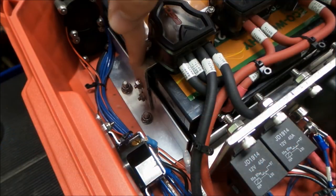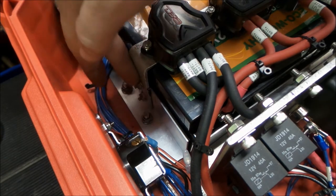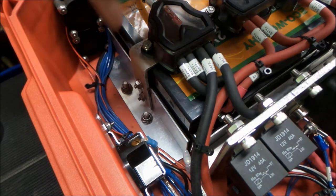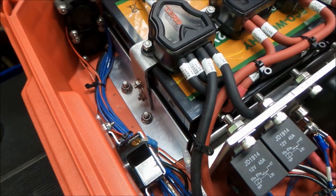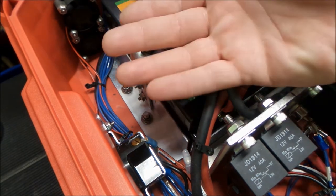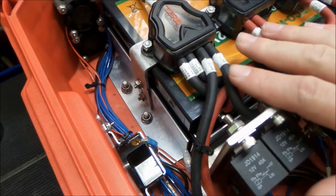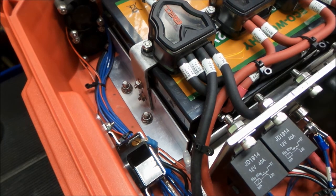This is just another piece of 10 gauge angle that I bent. It bolts through here. These are flush mounted screws that stick out this way, so the screws can't go into the batteries. And then this runs across the top and back down the other side. It's symmetrical. That's what keeps the batteries from going upwards. And then we mounted our blocks for terminations on that.